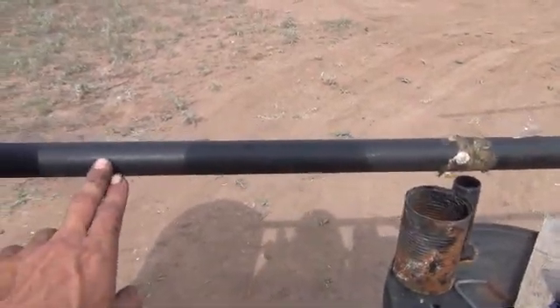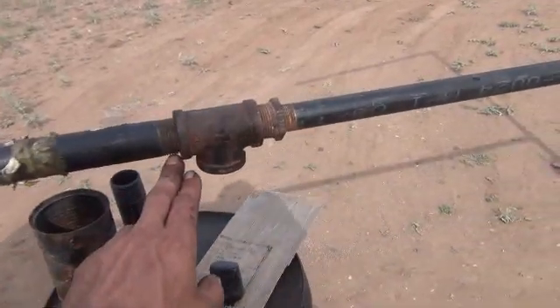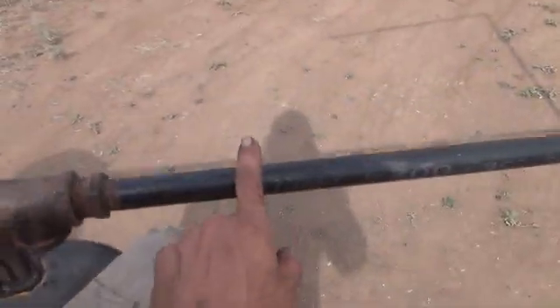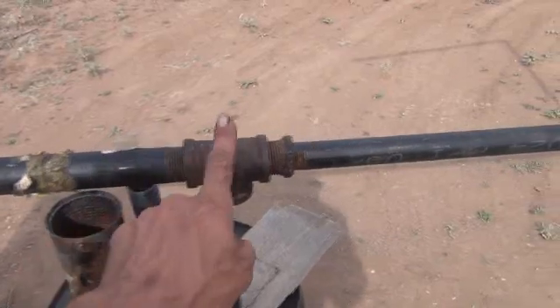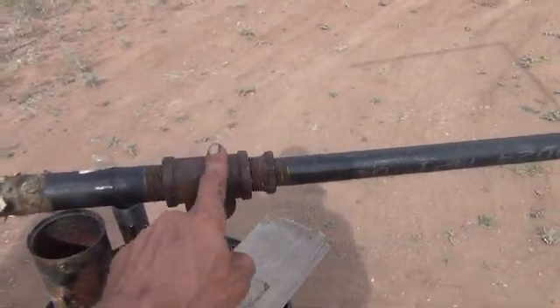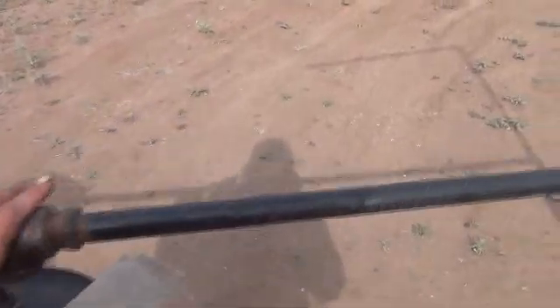It's a different form of creosote than you'd produce in a normal wood stove. It also allows for the creosote to roll down the bottom of the pipe, hit our T-block here, and run down into our first collection container. It goes into a smaller point here — it reduces. This is a reducing point right at the capture point. This will help restrict the pressure and help focus some of the cooling right here as a focus point for our first capture.